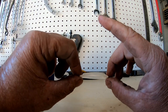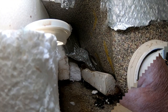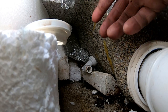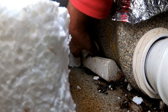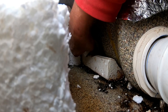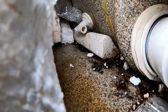Something about this gasket: it's an L-shaped gasket — it goes down and over, it's not flat, so it kind of sits into the side of the tub. You're going to stick the jet in the hole, then take the retaining collar — this piece goes on first and then the nut goes on afterwards. If you're going to work on spas you've got to get used to working with one hand in some spots because it is almost impossible to get both hands in there. And just like that, it's tight.